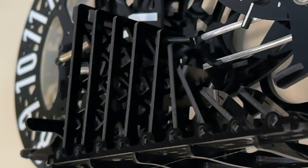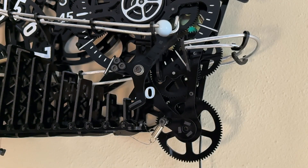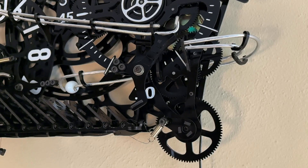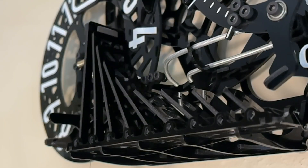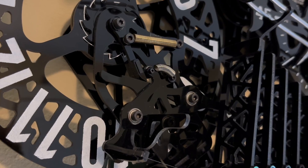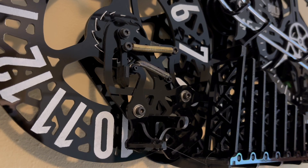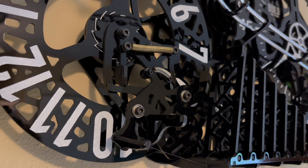Each system is kind of resetting together at the same time, but I'll explain it in the same order that the systems go off. After the marble hit the kicker, it rolled back down behind the clock and waited for this rotating elevator to pick it up and drop it off at the top to wait for the cam to drop again. Then once the dominoes have fallen, this crank slowly pulls them back up with a string that has a bunch of little stops, because all of the dominoes are hinged. This same crank is also resetting the ratchet system by pulling this lever to lock it into the gravity-operated latch, which stores potential energy in the spring needed to advance to the next hour. And this process just goes on forever and ever.